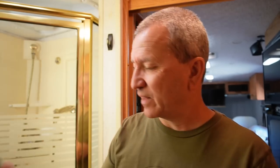Feels good, actually. So this is putting out probably a maximum of about 2,300 feet per minute, I think is the reading on that, and all the way down to say 2,000 feet per minute. So I'm gonna use about the 2,000 mark as my baseline, just so I have an idea. I don't think the new unit that I'll probably put in is gonna put out that much, but at least we'll know.